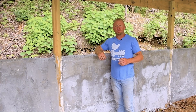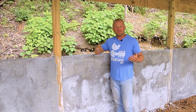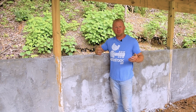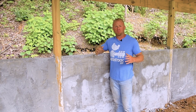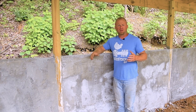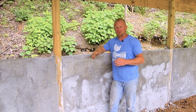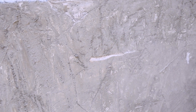Some of the issues with aircrete: I thought, what I'm making is a concrete sponge — I have all these holes in it. So if water gets into this concrete and then you get freeze-thaw, you're going to have worse cracking than if the concrete didn't have the pores. So wicking up water and water entering the concrete is one concern — which will also lower your R-value — and the other thing is that it doesn't have very much abrasion resistance. It's kind of soft, and you can scratch it. You can see how easily I can etch into that with a rock.